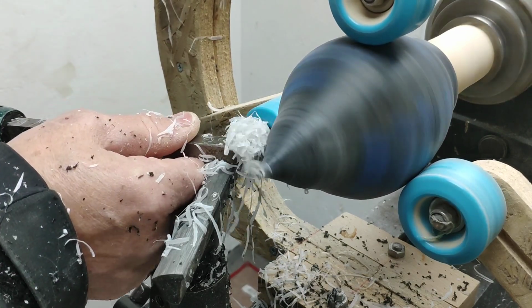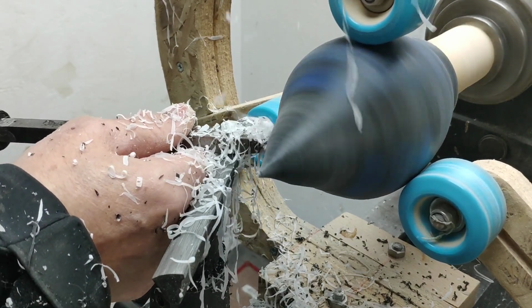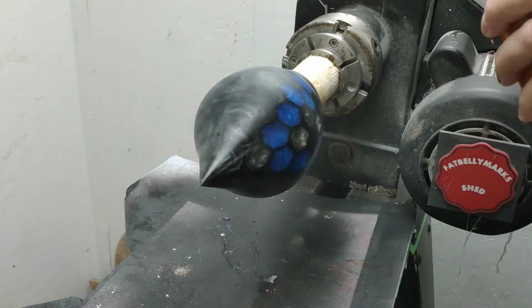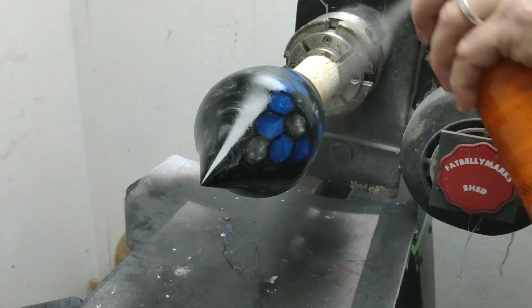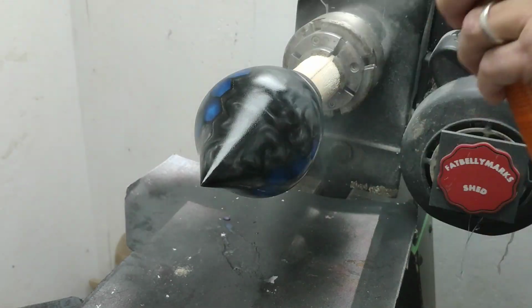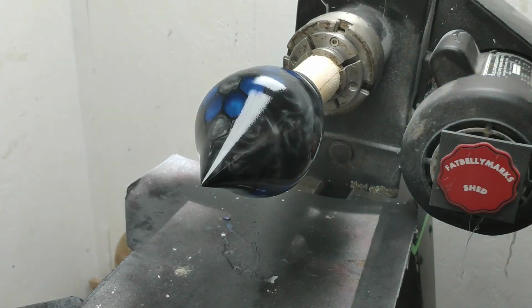By using this method, I have managed to produce a complicated design, with little turning and minimal usage of resin. The shape I wanted has been achieved. Numerous coats of lacquer are applied to give a super gloss finish. Now turning and sanding are complete. The surface needs to be built up to a perfect finish with about 6 coats of lacquer.